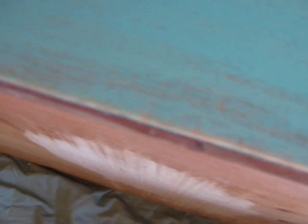I'm going to show you how I'm doing the sanding. I'm using a sanding block - I'm not sure what grit this is, but it's really coarse because I want to do the edges. This is how I get the worn look. You can go this direction with it and you can see it takes off a good bit of the paint - I'm not pushing really hard, just enough. Then I find my other sanding block which is pretty smooth - this is the 180 - and I just gently go over it to smooth it out a little bit. I want it to look like people have been grabbing this drawer for years and years.